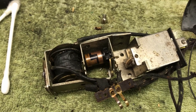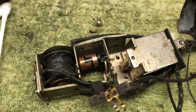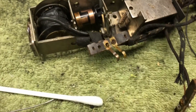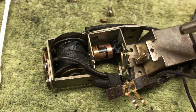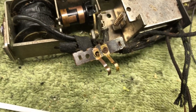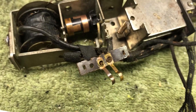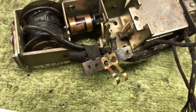I'm not sure exactly how well you can see this, but I polished half of the drum contacts and you can see the side on the right is a whole lot shinier than the side on the left. It's very tedious and time consuming, but the result is worth it for smooth operation of the reverse mechanism. I've also extremely gently polished the fingers — just the tops of them — so that the electrical contact will be much smoother, and got rid of some of the tarnish.